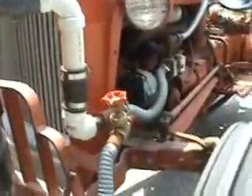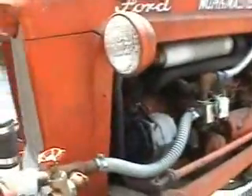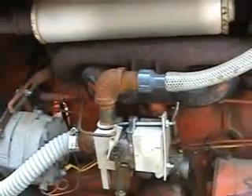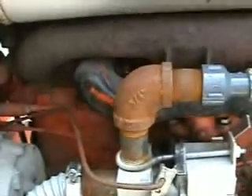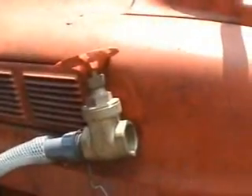Here's where I pipe in for the suction. Once again my little blower — it seems to do a pretty good job as long as things don't get too hot. The flexible piping comes into the carburetor adapter, which has basically two throttles that are linked — a gasoline throttle and a wood gas throttle. Right here is where the fresh air is mixed with the wood gas, prior to the throttle. This is the mixing valve, within reach of the steering wheel.